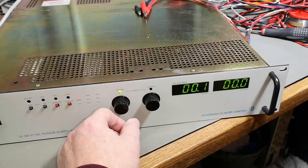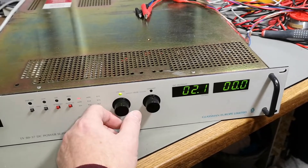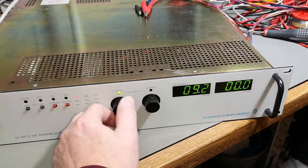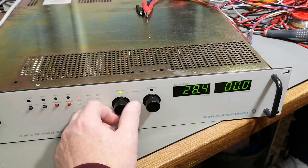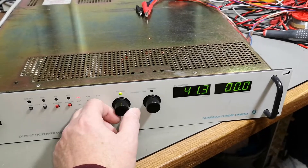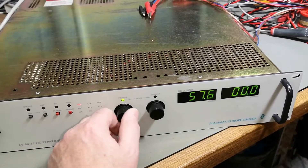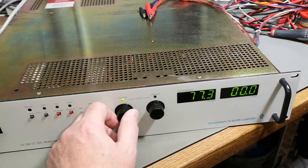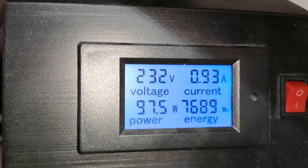Let's do it again — at low voltage it's 30 watts, then 50 watts, then 60, 70 watts. This is a classic Sorensen power supply design — the entire DCS series does this. The idle power is super super high, so at 80 volts of output the idle power is 97 watts.